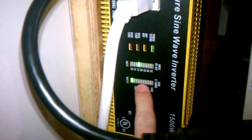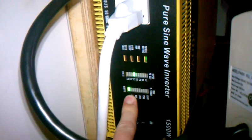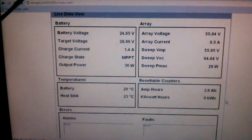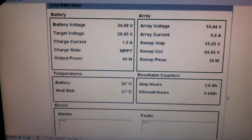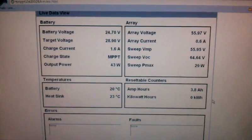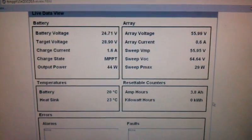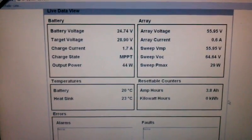The washing machine has stopped spinning. You can see the watt meter is barely registering even 100 watts. The washing machine will register about 145 or 150 watt hours total when it's done, so it really doesn't draw that much power — just a few phases of the cycle. The voltage is now 24.67 volts. It does drag the system down under heavy utilization, and there's a little return spike here when the motor shut off. But it really hasn't moved much overall — I'm only bringing in about 30 watts. When I had everything shut off, the battery voltage actually went up to 26 volts, so this thing charges really fast.